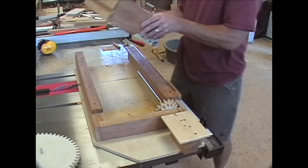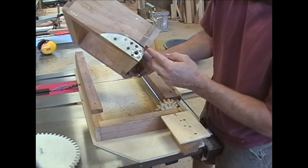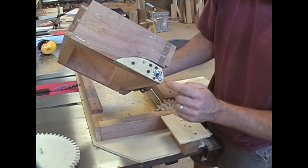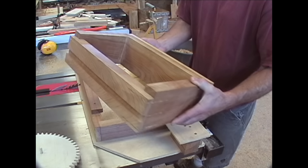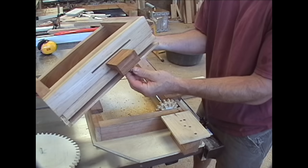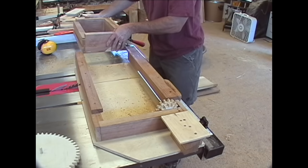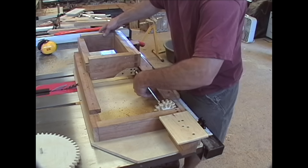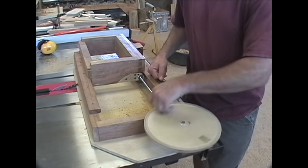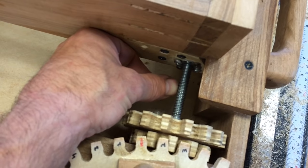The carriage is just a box. It's reinforced with splines, it's got some grooves on it to run on the slides, and a T-nut with which it's driven by the threaded rod. Very simple construction, no big deal. The thing on the back is just a little spring mechanism that holds it firmly against the slide.